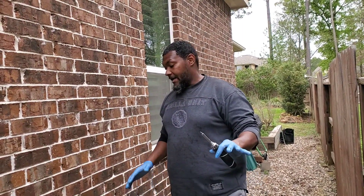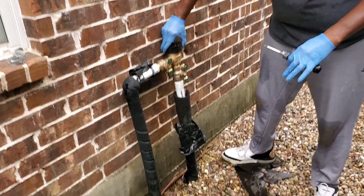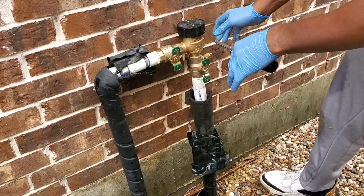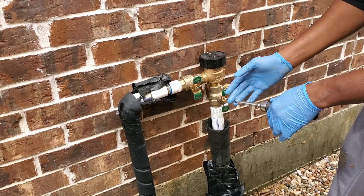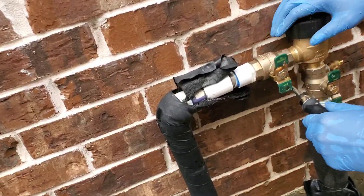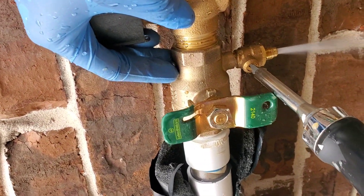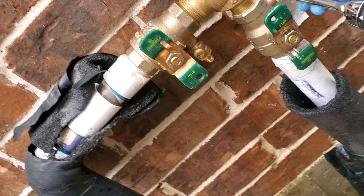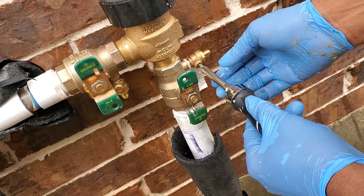All right guys, I just turned the water back on and everything is working. This may not have been fully screwed on — when I first came back, I had water leaking. All you have to do is adjust this top piece, which screws on and off. I tightened it up and it stopped. One thing you may notice is this little valve here — there's a screw where you can test it to make sure the water comes on. Just screw that back tight and it'll keep the water from leaking. Whenever you cut your water back on after winter, you always want to come check this and make sure water is coming through before you turn your sprinkler system back on.